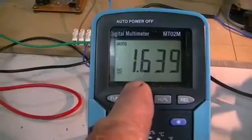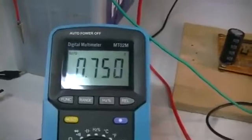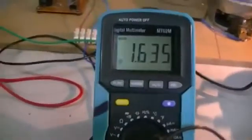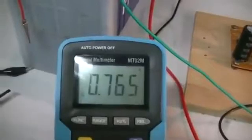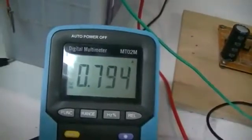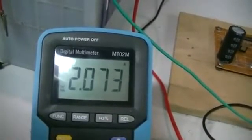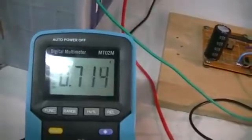That is the current draw from our battery at the moment. That is the current flowing through the light bulb. As you'll see, as the battery voltage goes down, this current will go up — contrary to what it should be — and that is how it is working. Now, the other thing in question: how come the current on the motor was higher when I put the light bulb off than when we first started it? If I put the bulb off, you'll see the current will go up and then slowly come down because the motor is slowly picking up speed — like so. Then turn the light bulb on, and that is what we have.